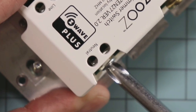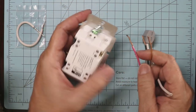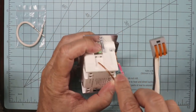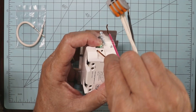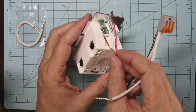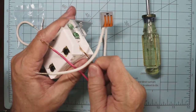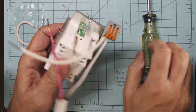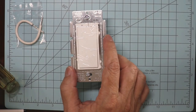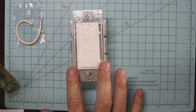When installing the ground wire — the bare copper wire — you'll see a couple of holes up top. Just push it straight in and you're good to go. After tightening everything down, give each wire a nice tug to make sure it won't come out once you're moving things around in the wall box. On the sides of these switches there are little tabs — if you're in a box with two or three switches, you might have to break off one or both sides of those tabs to make everything fit.